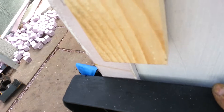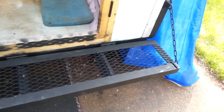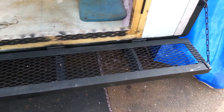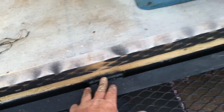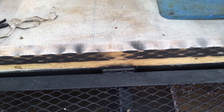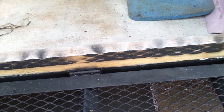So I put them on the inside. I like having this little step here — I fish a lot, it's a good seat to change waders, a good spot to put tools on, cook from, whatever. I welded chains to support it and put three door hinges here. We'll see how long they last. I welded them on little plates so they'll be easy to grind off.